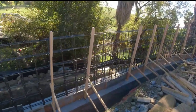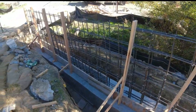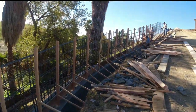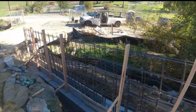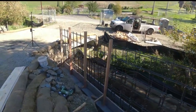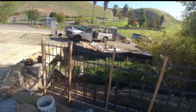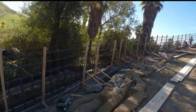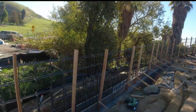All our main stakes are 2x4. They're approximately about 3 feet on center. We normally go 4 to 5 feet, but because of that curve, we're doing some extra staking here. It shouldn't have a problem, but just in case — I kind of like to overcompensate.